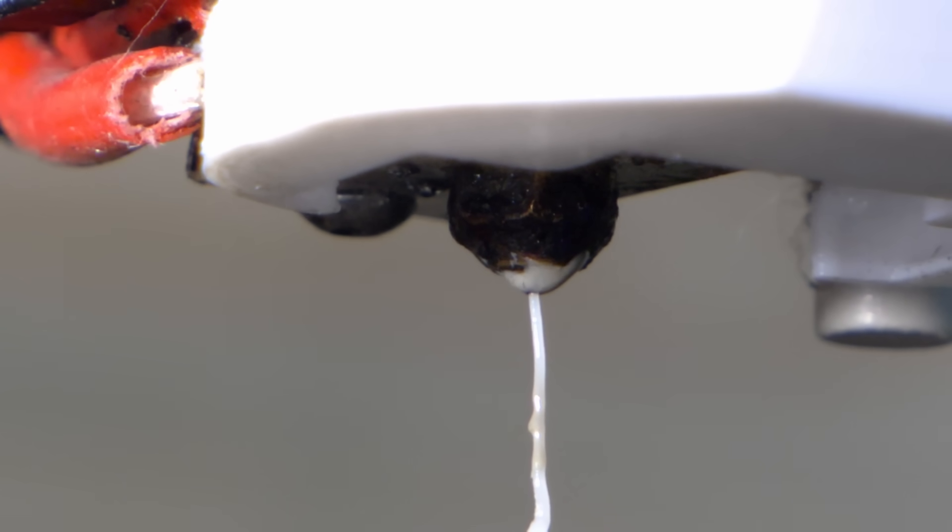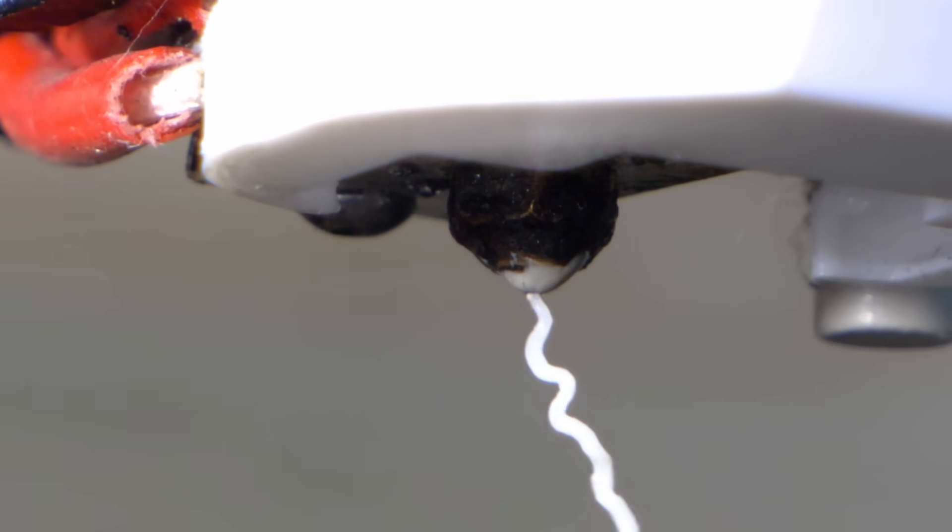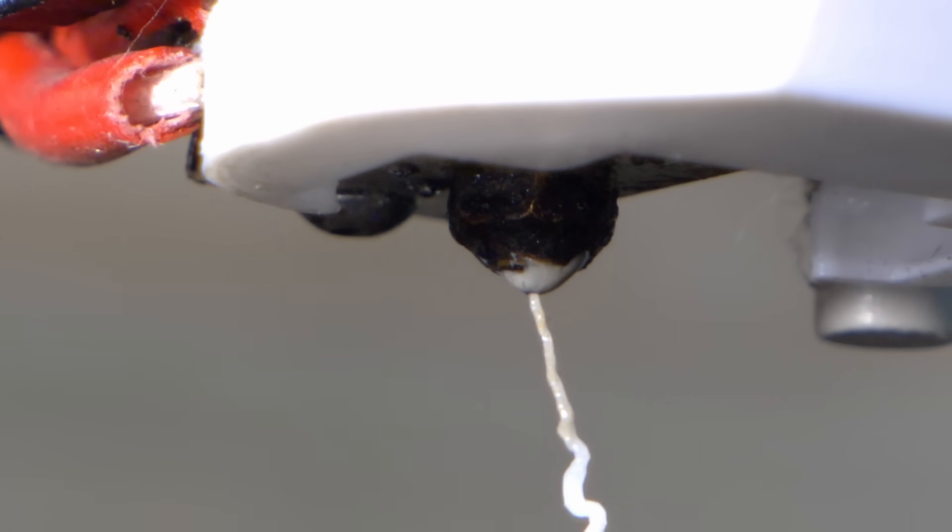This type of filament contains a compound that adheres to most polymers and byproducts and completely clears out the nozzle as it is fed through. I usually set the hotend temperature to 10 degrees more than the filament that clogged the nozzle, and then just push it through, which does the trick.